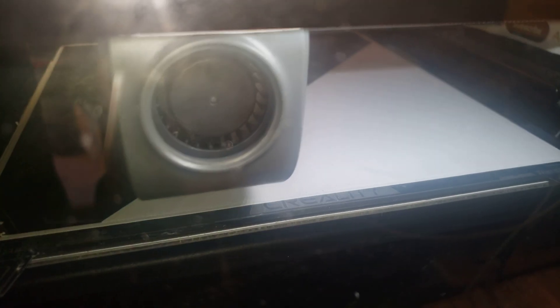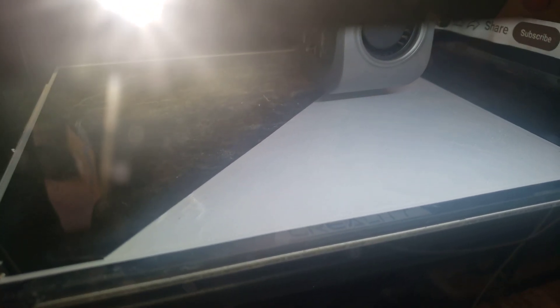What I did here: I narrowed the minimum line width to 0.23 millimeters. From what I understand, to calculate the max line width it just doubles the minimum, so the printer can vary the line width. Some people don't know that the slicer will adjust the line width in order to best accommodate the final desired geometry.